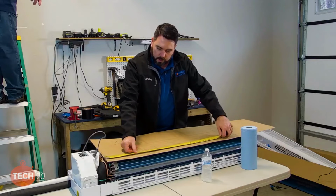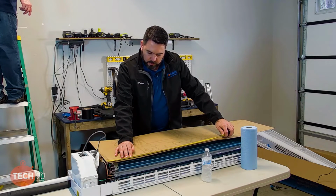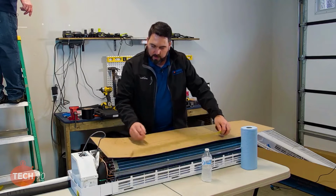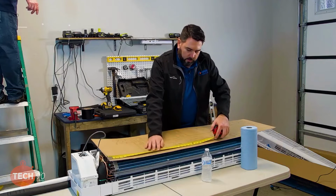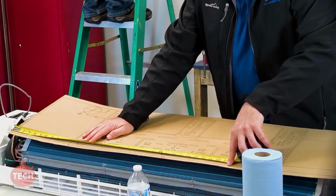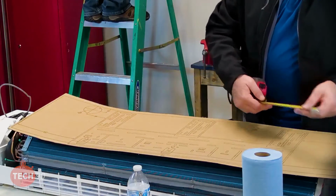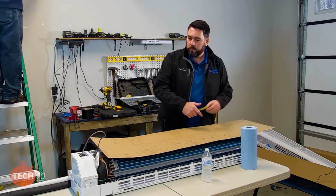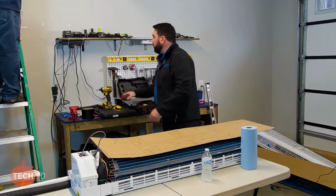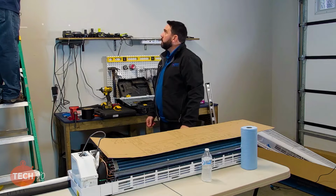All right. So on the right-hand side, we have 10 1/4 inches to the bracket. What's at the center from the right side? And then to the center of the bracket, we've got 25 inches. Okay, so I'm going to be an inch off. An inch off. So I measured 26 inches to where my end of, which in this application it's going to be fine, because all I want to do is make sure I was well clear of the garage door. Right. And the bracketing for the garage door, so that we're not throwing air over the garage door.